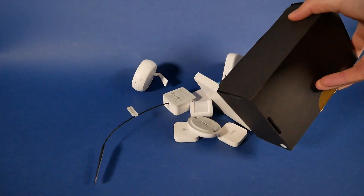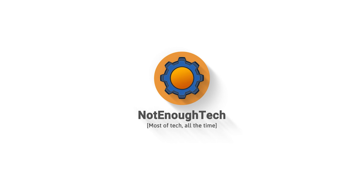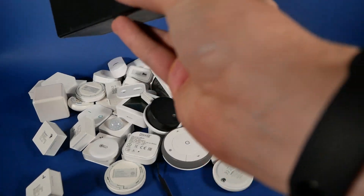I've got a Zigbee problem and it's a serious one. What you see are the Zigbee end devices, and if you're using my favorite CC2531 — which I've been recommending for ages — then end devices are your doom. Without a properly developed mesh network, you will reach the limit of how many devices you can directly connect to a CC2531 really quickly.